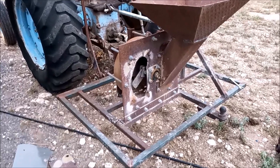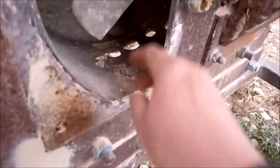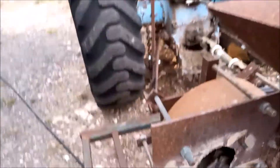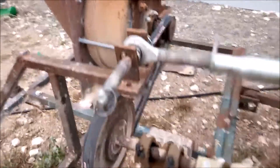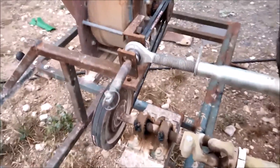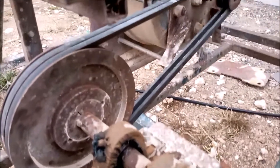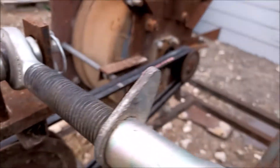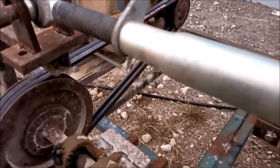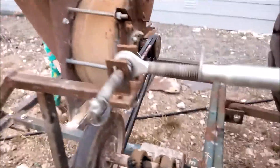A lot of you have commented about using something like this to crush gold ore. I reckon if you made the holes in the bottom quite small — maybe 10mm — you would grind it up into a very fine dust. The smaller the hole and the faster the belts spin, the more pulverized it becomes. In my case I don't want pulverized rock, so I won't flip the pulley ratio around because then it would jam all the time. It's not really a rock crusher — it's an impact mill, but you probably already figured that.